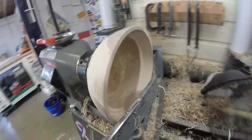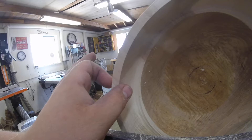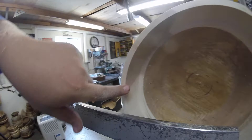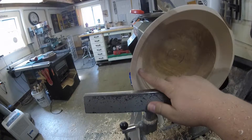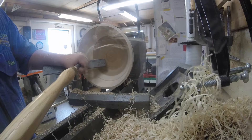Here's how I turn the inside of a bowl — it's a pretty simple method but it'll help a lot. I work my way in maybe inch by inch, making passes with the bowl gouge. I've got about a quarter-inch wall thickness up here and about an inch down there. The reason I work in little by little is that all this thick meaty wood down there supports my cuts up here. If I just made pass after pass to get the wall thickness down at an even rate, it would start getting thin and wobbly, giving me a really bad cut. Doing it this way gives me support to make cleaner, easier cuts.